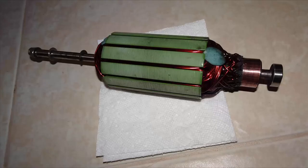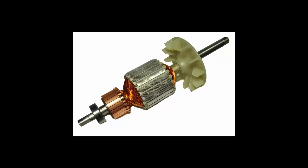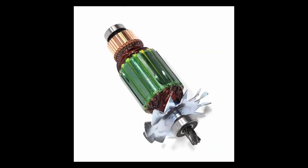This armature has no cooling fan to circulate air across it while running — that's why it overheated. I suspect all trolling motors lack a cooling fan on the armature, whereas every other motor I've seen always has a cooling fan forcing air through the armature. The engineers apparently assumed the water would keep it cool, but the water can't cool the air inside the armature without a fan. This is a severe engineering problem likely affecting all trolling motors, so keep that in mind when using your trolling motor.